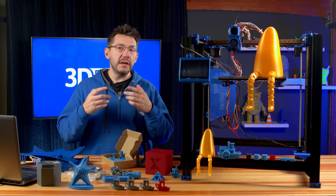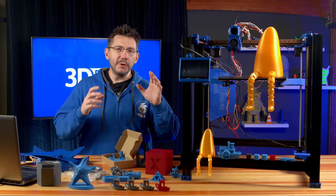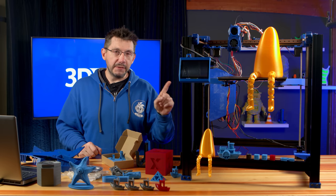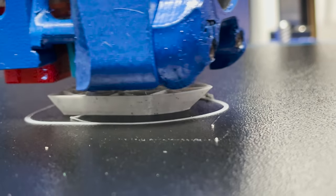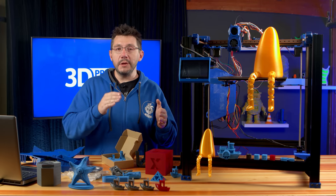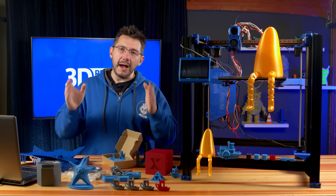Is there anything I would change? The first thing I would change is the way the machine is packaged — rather than bubble wrap around all the extrusions, I would utilize custom cutout foam. I think that's going to be the key to getting these things safely to customers. I would also change the build surface. Right now it's using a BQ flexible build plate. I didn't have the best luck with adhesion on that, so I swapped in a flexible plate with PEI that I use on my Daedalus from Project R3D, and that seemed to work a lot better. I'm not saying the BQ sheet is bad — I'm just saying I didn't have a lot of luck with it.